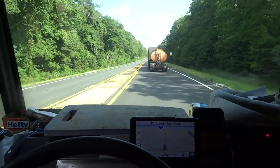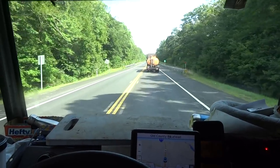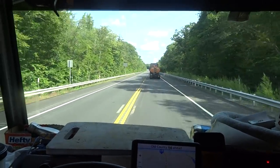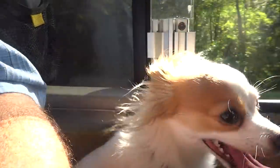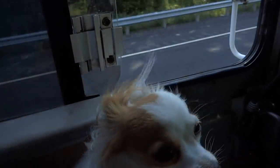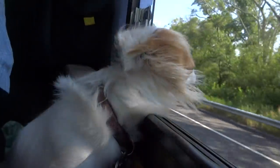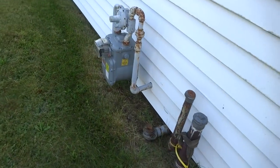So that's what I'm gonna do. I'm gonna go over there and put that conversion burner in. And this way, when they run out of oil, it's just a matter of going over there and swapping them out. The gas pipe will already be done, already hooked up, ready to go. It's just a matter of one connection and a couple of bolts, and boom, be done with it. Gas pipe and the burner all set, ready to go. So when we run out of oil, the gas pipe will be all ready to go.